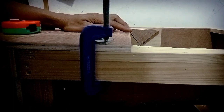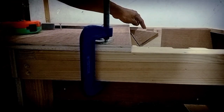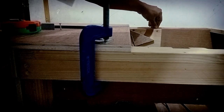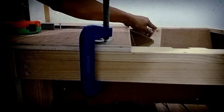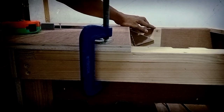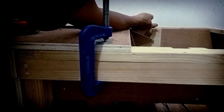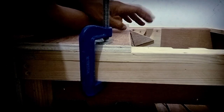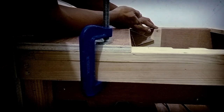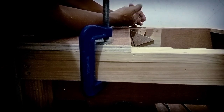Why does this situation occur? Because when we install the 45-degree tilt mechanism, there is usually a gap here of 1 or 2mm. For example, a 1mm gap — that 1mm gap is very significant to the blade position here. If the mechanism height is off by 1mm too high, it will also affect the blade by 1mm. It's indeed difficult to get it exactly right — not a millimeter too much or too little — during construction.